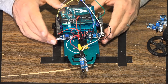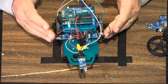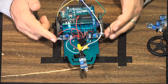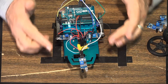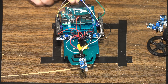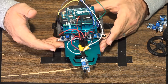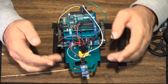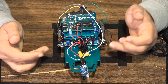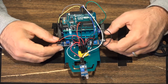One thing to think about when building these projects is sensor placement. The Arduino vehicle can only respond when the sensors actually detect something — they are essentially its eyeballs. You have to ask yourself where is the best place to position them. Should they go up front, on the sides, or in the back? For this simple project, I decided to put them along the side.